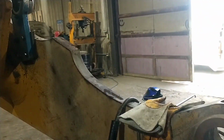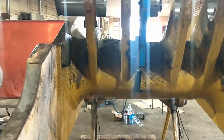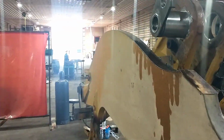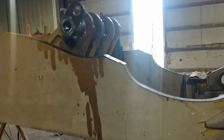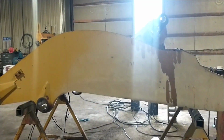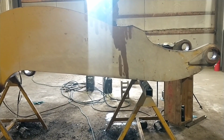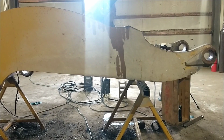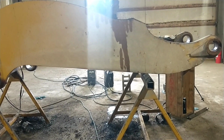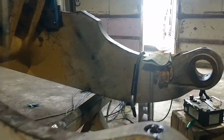Anyway, I just found out something interesting the other day. I finally saw some build prints for a JRB quick connector, and found out that on a 100 millimeter pin, their print calls out 0.2 millimeters, so just shy of 8/1000ths worth of clearance on the pin, and the tolerance is plus or minus 4/1000ths. So when they make one, it's got anywhere from 4/1000ths to as much as 12/1000ths of clearance right from the factory, brand new.